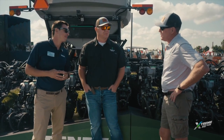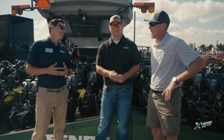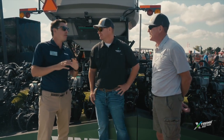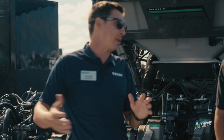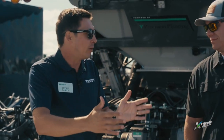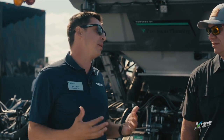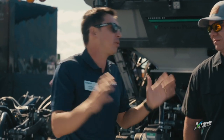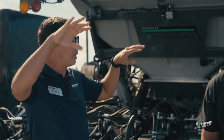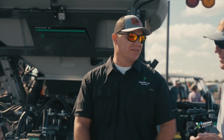I'm going to go ahead and just tell you the truth — when I saw it come out of Classic, you kind of geeked out on planters and here you are, still doing it. What else did I miss when it comes to the technology? Before we talk planters, we talk agronomy. We start with the problems and the agronomy and the solution and we end up talking about planters. When you talk pinch rows, every planter on the planet has tires next to each other. You try to plant in the middle of two tires, you have compaction on both sides. It's going to impact your root system, harder to uptake nutrients and water, and it's going to impact your yield. Having the tires in front of each other is a great benefit, and it was purposefully designed so we have no pinch row. You can plant thousands of acres and we will never leave a pinch row in the field. This impacts how good that corn or that crop will look, especially in the center frame. With a 15-inch spacing where that tire is in front of that row, it's hard to get that seed in where it needs to be — we see it on the downforce maps all the time. That row is always up out of the ground. So this makes a big difference.